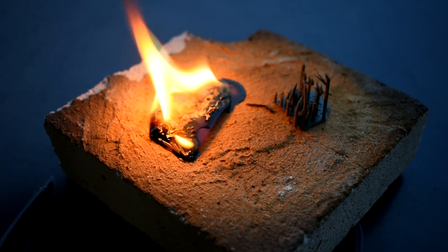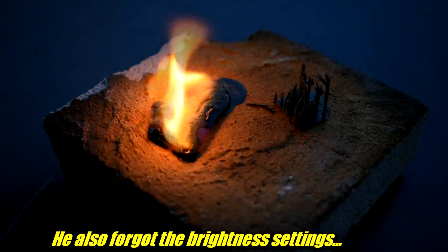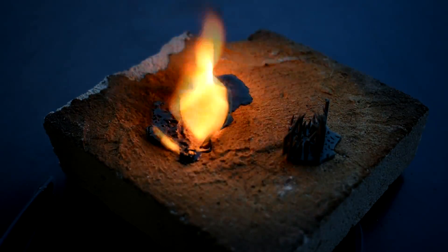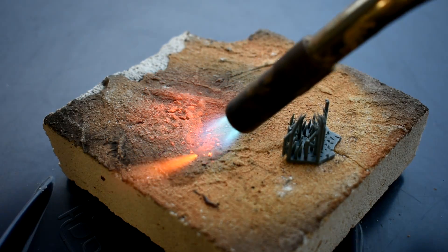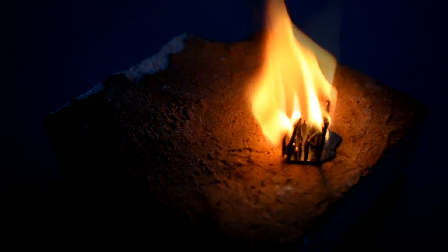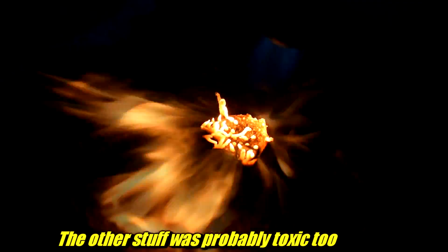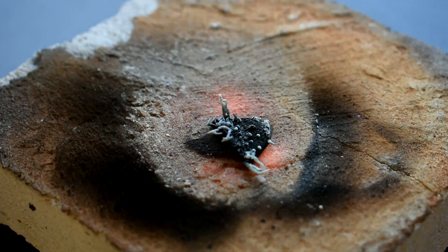Here's a demonstration to show the issue. On the left, already burning because some idiot forgot to start the camera, is the casting resin I used last time. It's got a wax content to it and you can see that it burns and melts — it forms like a puddle on the brick. If I keep blasting with the torch, eventually it all burns away. I can even clean the dark spot off the brick with the torch. There's nothing left. On the right is normal printing resin. No melting, just super toxic smoke and eventually a burned chunk remains.